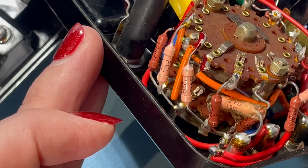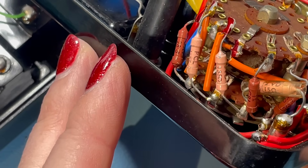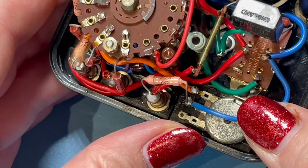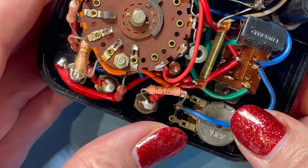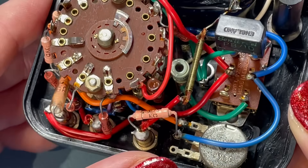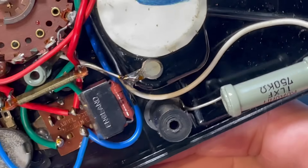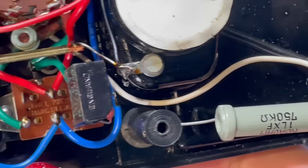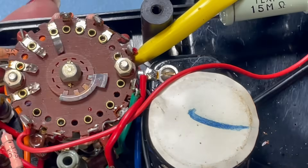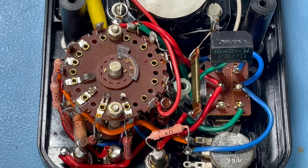These are mostly one-percent resistors — this was very well built. There's the potentiometer for adjusting the ohms range. And that switch down there? Aerial pressings, made in England — all made in England! This is fantastic seeing such quality components in here. The selenium rectifier is really clearly visible. It all looks pretty nice and clean. Really nicely put together meter with quality components and really nice workmanship.